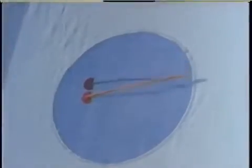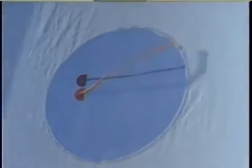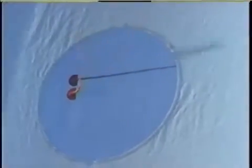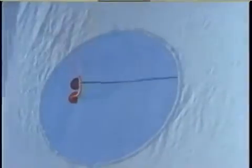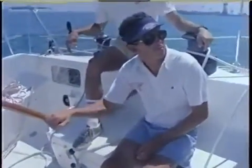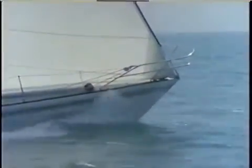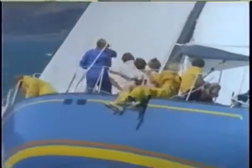The weather side telltales are much more precise as a trimming and steering aid. They gradually rise in angle as you sail higher, finally fluttering as you pinch too much. There is no single angle that's always correct. Some conditions call for footing, with the telltales nearly horizontal, while at other times, high pointing is best, with the yarns at 30 or even 45 degrees above horizontal.